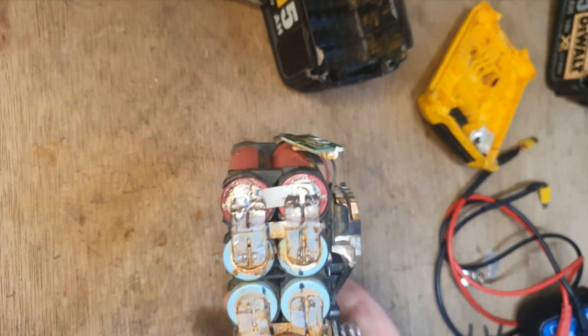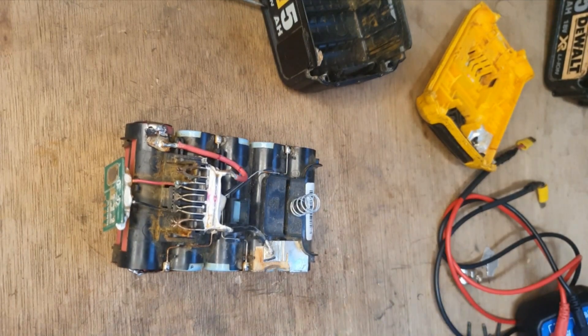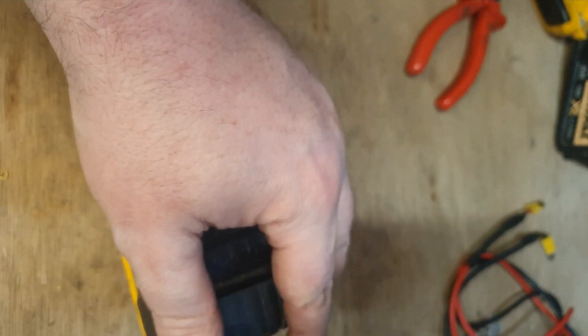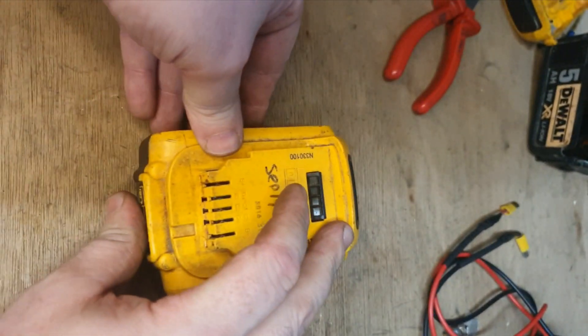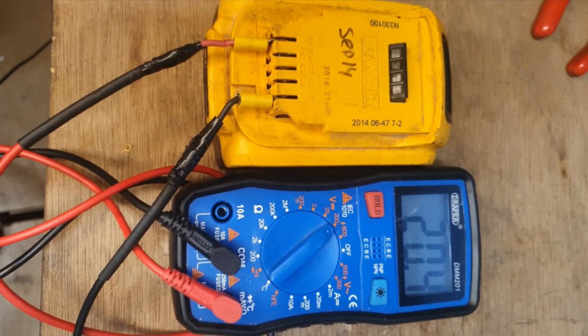Here we are now — won't be winning any beauty contests, and there are no guarantees how long second-hand cells will hold up. But it's showing three bars — I think we've got a good job. We'll just put it together and check the voltage: 20.4 volts — that's absolutely perfect. So that battery is totally fixed now. You can see sometimes why the jump start doesn't work — that was slightly more complicated than I thought. You can decide for yourself if it was worthwhile. If you like this video, please give it a thumbs up and check out my channel for all my other content — plenty of battery videos and more every week.